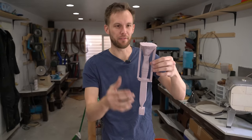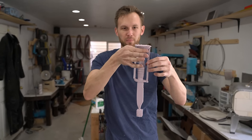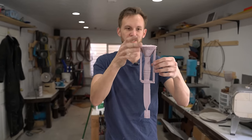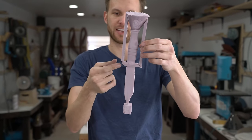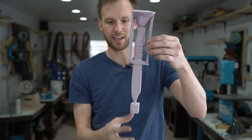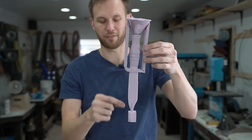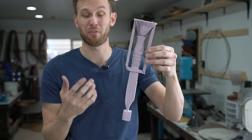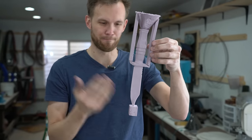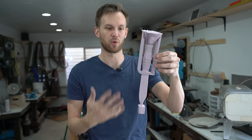So I've got the actual knife shape, then I've got this cone at the top — that's going to help me pour all the brass into the right spot, with the sand built right up to the edges. These two side pieces are just to help brass flow so it does a better job getting all the way down into the guard. I've got a block down at the bottom so that brass has somewhere to go as it flows down through the knife — I don't want it to get to the tip and get stuck. I'm going to be pouring into dry sand, but I figure the gases and burning styrofoam need somewhere to go rather than get stuck in the tip.